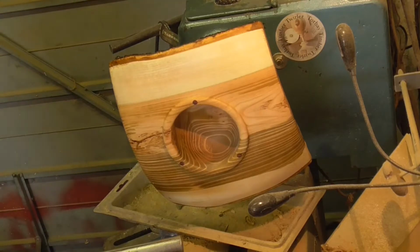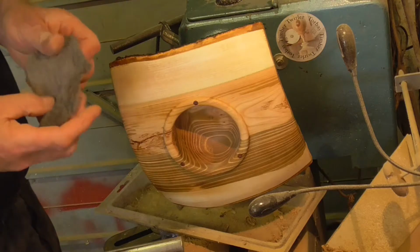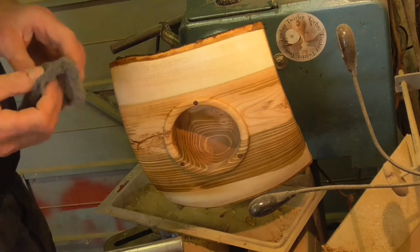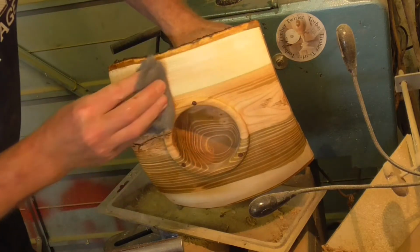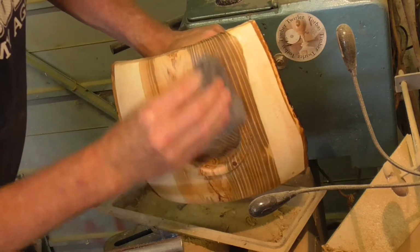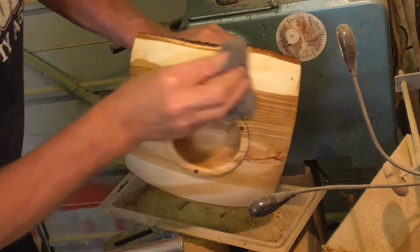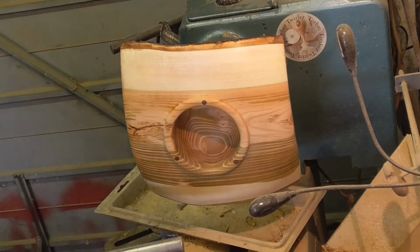Right, it's had the final coats of sealer on it. Get the worms out in a minute. A quick wipe over with some quadruple 0 wire wool, make sure there's no bits that I've missed. Quick wipe up with some Meths DNA. And slap some polish on it.